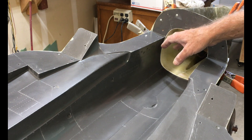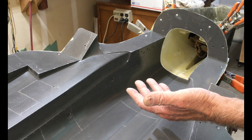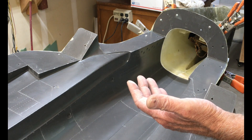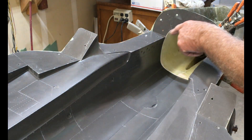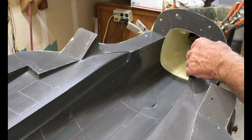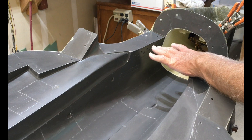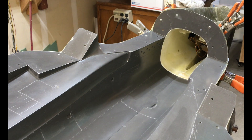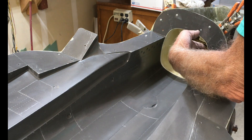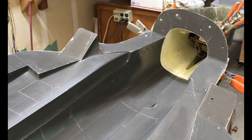The seam cloth will hold the majority of it because this section is bigger than this one. It's better to do the top first and get the majority laid up, then lay the bottom mold up separately — the normal way we do it. When joining them together I'll goop around the seams and goop here with some glue so it closes up and clamps. Later we'll cut out the canopy which lets me get in deep and put tape in there for complete closure at the rear end.